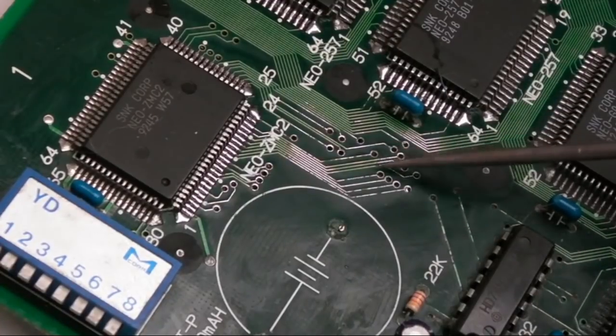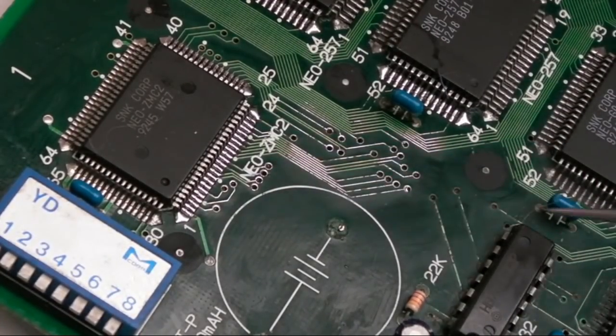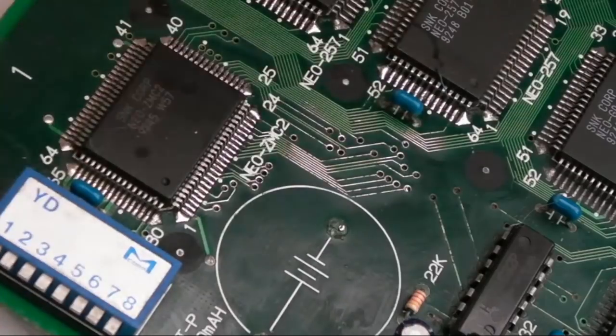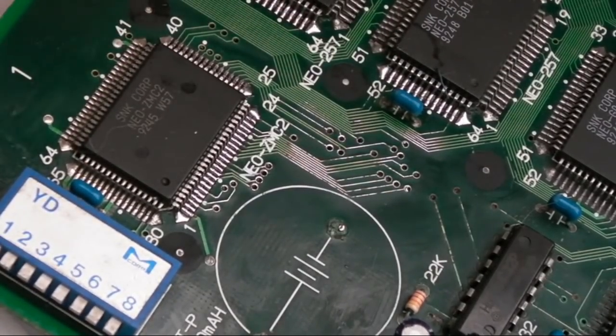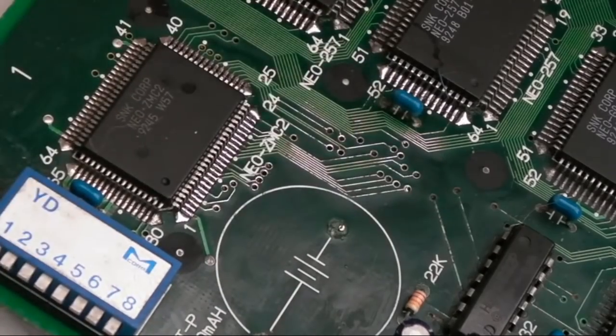But I've not quite finished here yet, because you can see I removed the wire there, and obviously the line is back. I tested that. Test at various points when you're doing work like this, just to make sure it's still working as you've done a bit of reflowing around a few things, because you could introduce a fault by damaging one of the traces you're trying to fix, and then add to that problem